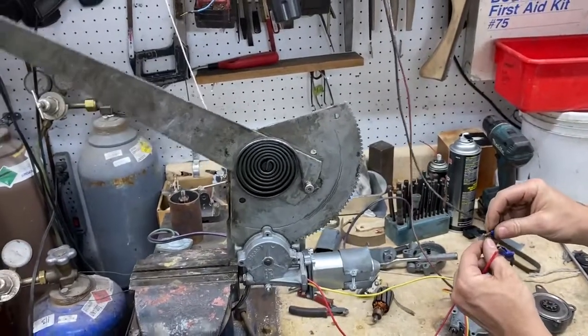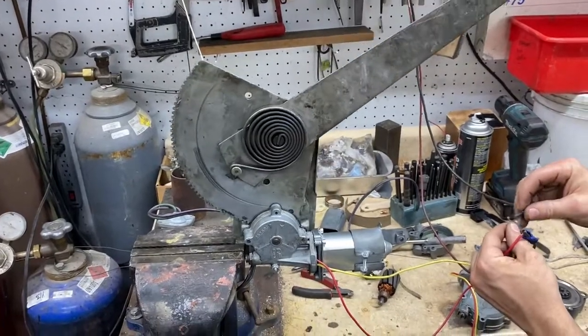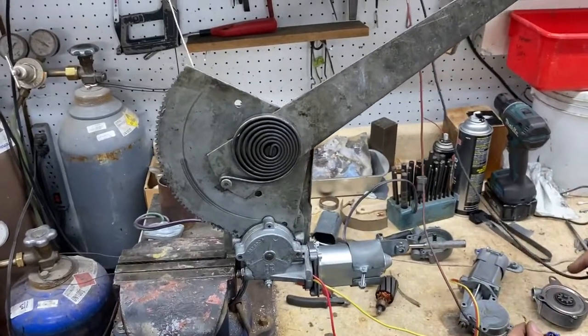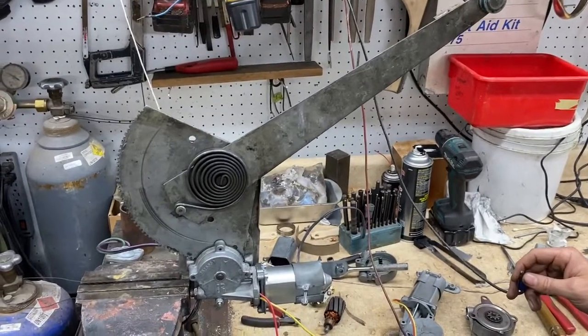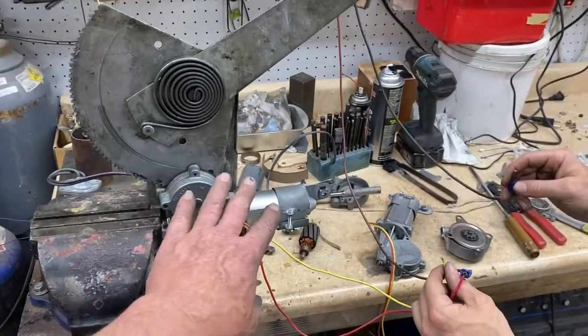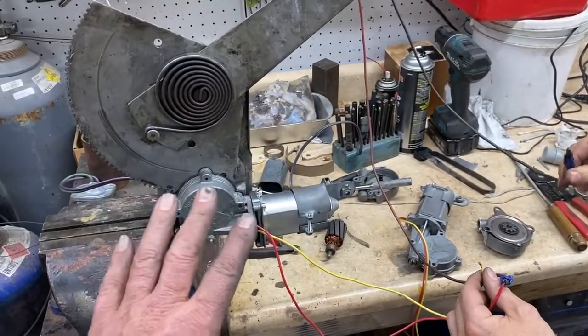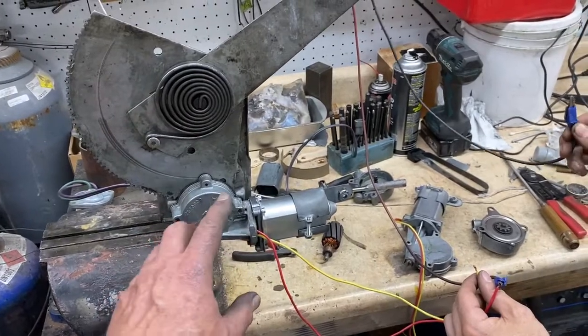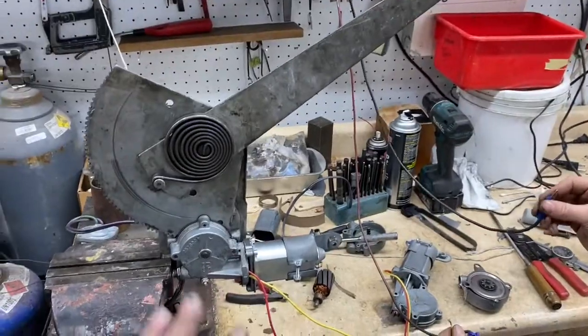We might mention that the switches in these take the full load of the motor. There's a very good chance that the switches in these still need to be redone. We've done many, many of the electrical switches that take the full amperage load of the motor. It's very simple for us to put a relay in this system so that it sends a signal to the switch that's only a tenth of an amp. I would recommend that.